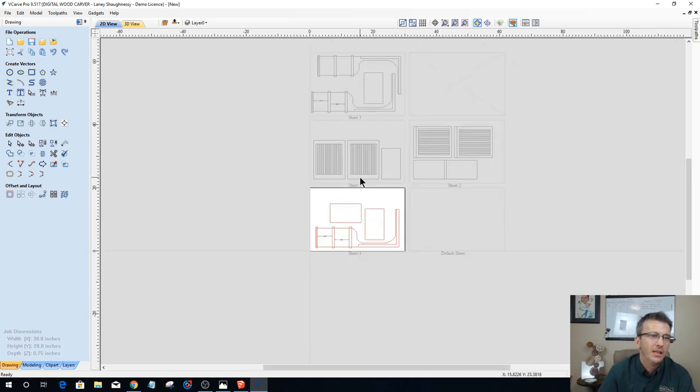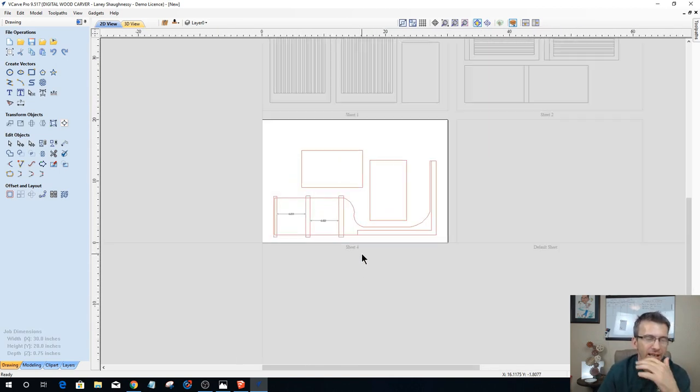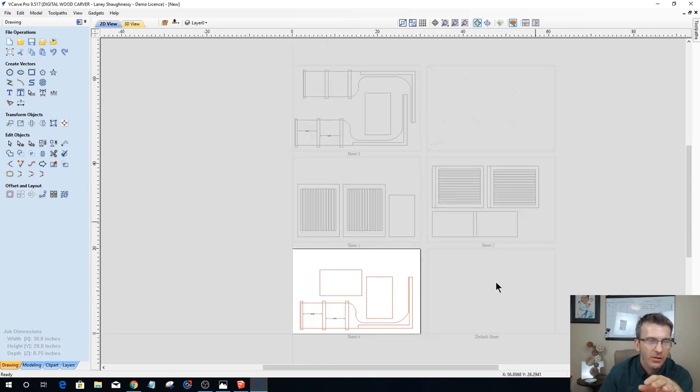And now is the perfect time, by the way. If you're ever doing that, guys, think about nesting objects. Not nesting like we're doing here, but I'm talking about nesting projects. So this is the shelf, right? This is the kitchen rack. And I've got dead space on this sheet, on sheet one, on sheet two, and some space on sheet three. If I have any smaller projects that need to be cut out on the same material, gang those projects up. Fill in those sheets as much as possible. Optimize that runtime. Optimize those cuts. Knock them out. You've got some dead space in there, and that's the perfect time for any smaller items that we can fit in, right? Optimize. Okay.